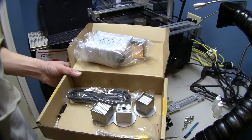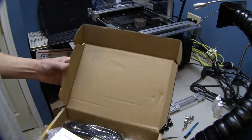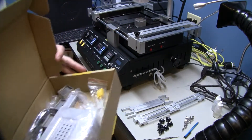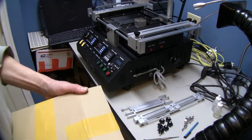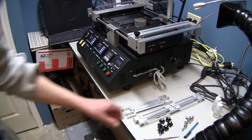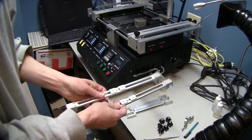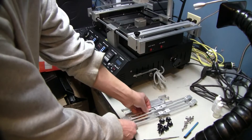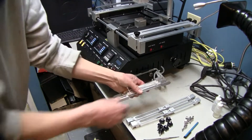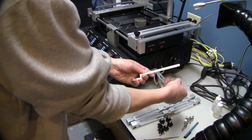Then you have some different nozzles — we put a couple on the unit. This one only came with a 41mm as the largest, so we went ahead and put the 41 on the bottom and the 55 on the top for now, until we ordered a 50mm to come in for re-balling videos. Also in the box you have some rails which we are going to install for board support. We will be putting on individual side rails shortly.